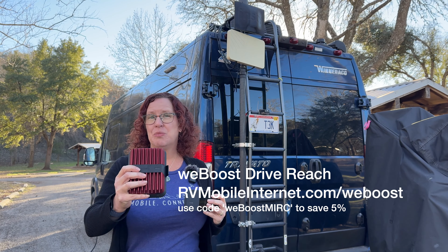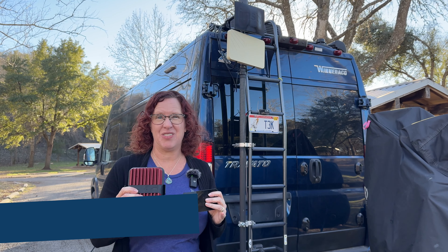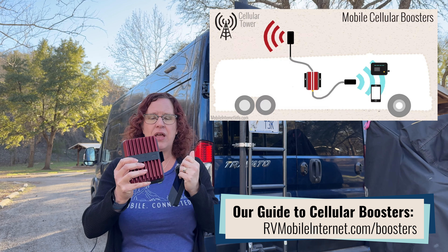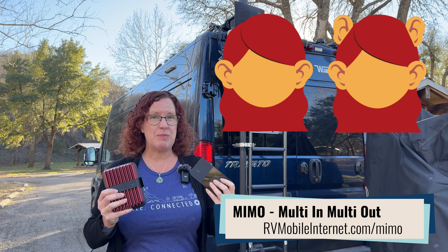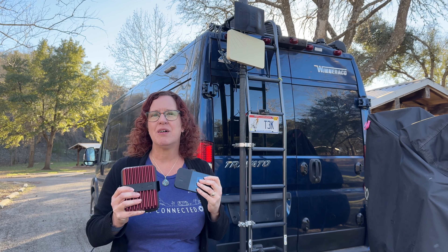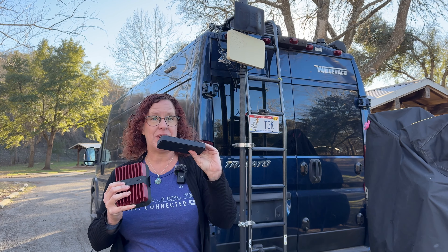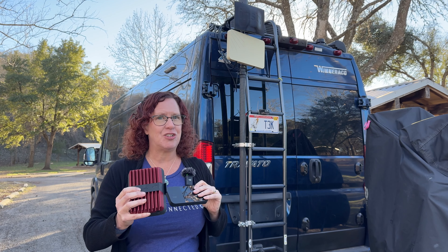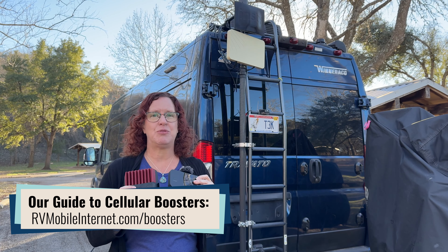Another option is a cellular booster. These have traits that make them not ideal for cellular data improvement — number one, they only use a single cellular antenna on the outside of the RV or boat, then transmit through an amplifier and out an interior antenna. This negates the properties of MIMO — multiple in, multiple out — which exterior antennas handle better. Cellular boosters also only cover a small handful of cellular frequencies used by carriers. However, when you have a metal RV and devices without external antennas like hotspots, smartphones, or tablets, a cellular booster may give you an advantage in situations where it might not be as useful in a fiberglass-constructed vessel.